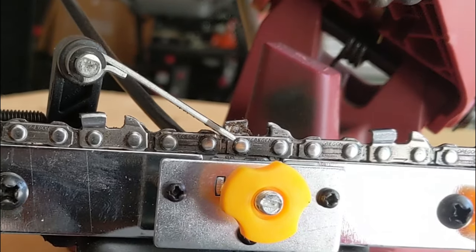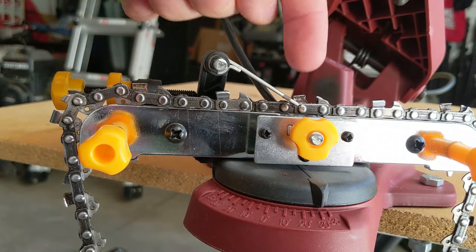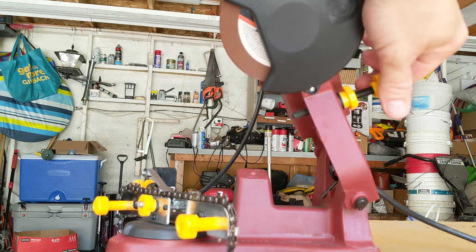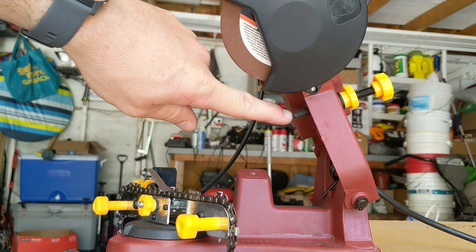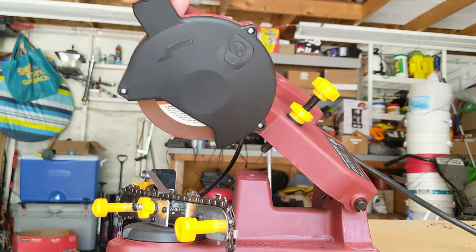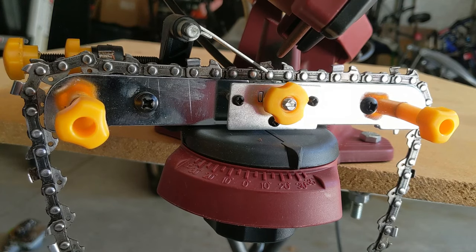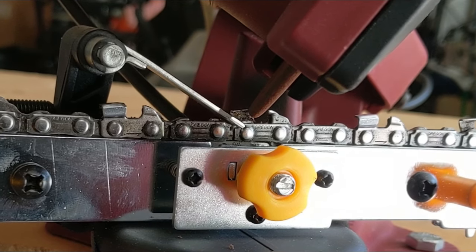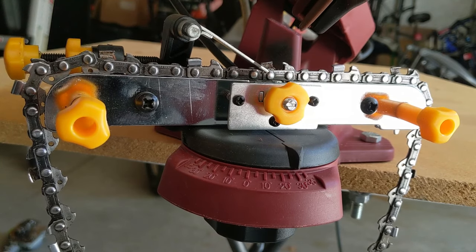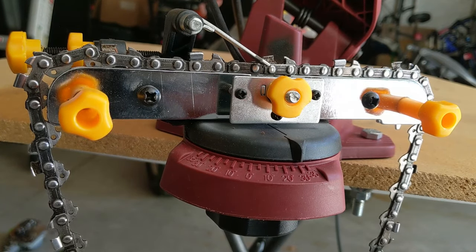You just want the edge of that grinding wheel to be touching or grazing the angle of your blade. The next adjustment is the depth stop screw. Turning it adjusts the height of the depth stop, which hits this plastic piece and controls how far down you can bring the grinding wheel. As the grinding wheel comes down, you want it to stop right as it's grazing the edge of the blade. You don't want it going down too far or it will start cutting into the chain itself — adjust the depth so it stops at the right spot.